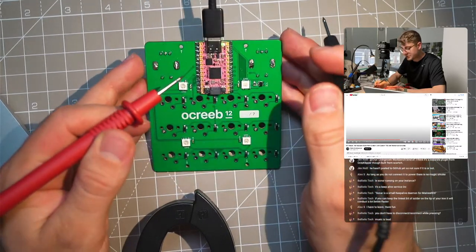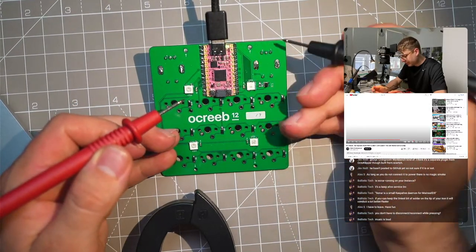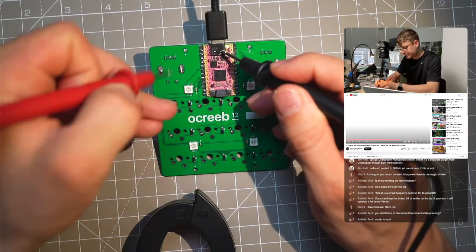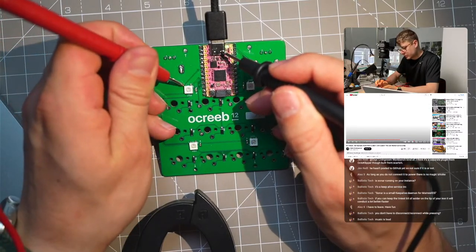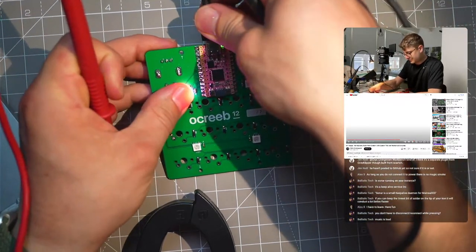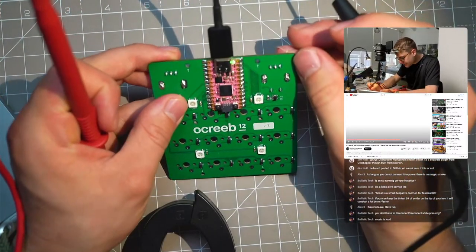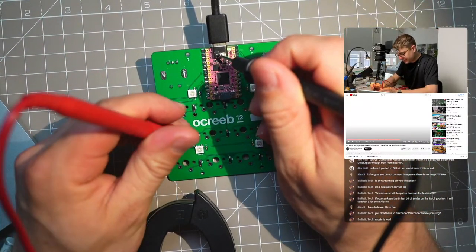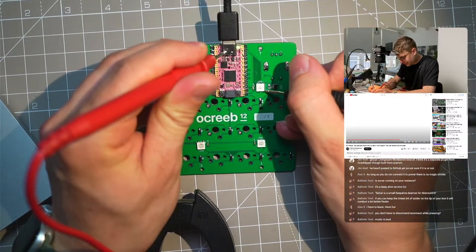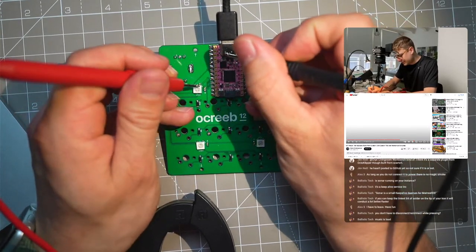this then seems to be a signal issue, right? Because we have kind of ground, and we have kind of... yeah, if I touch this pin, the LED turns on, which is the pin next to the notch. But for this one, that's not the case. So it's only that one. And this one has a continuity with ground, the pin.